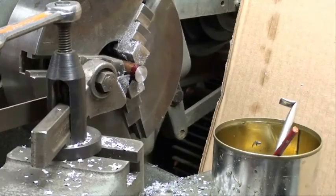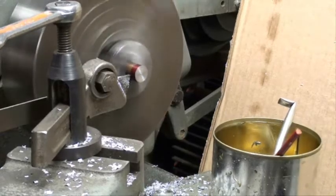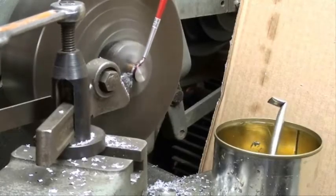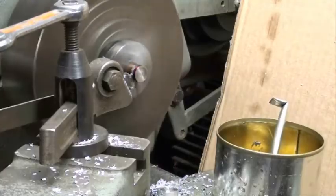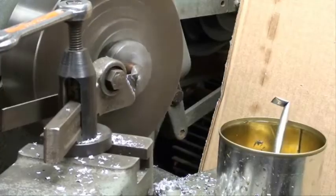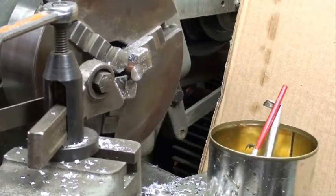I failed to mention that it's absolutely necessary that your tool be on true dead center, and also that your tool be set perfectly perpendicular to the work — not at a slight angle. Here we go — this is half-inch round steel. You can hear there's a lot more vibration, but it didn't take too long to cut that off.